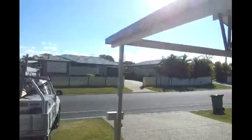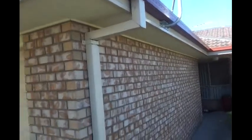You can see underneath from earlier our hockey stick brackets holding out the back beam here. Looking quite nice there. We've managed to install our polycarb infills. That's going to let a bit of sunlight in and also give weather protection. You can see here, same again with this gutter, all the way over to there. The water's going to be coming into our little junction there and down into this downpipe. We'll go for a wander out the back and show you the other patio that we've constructed.